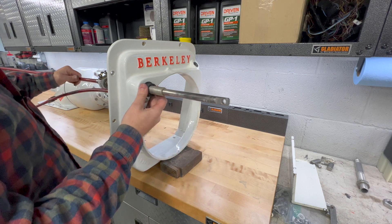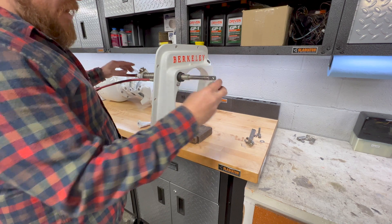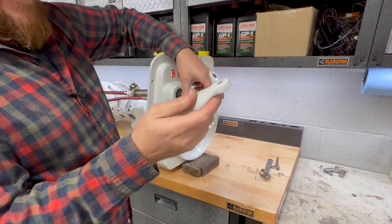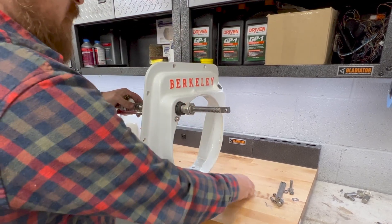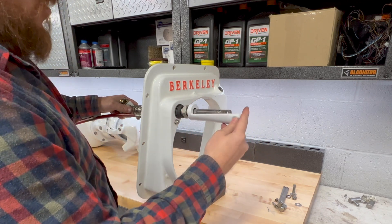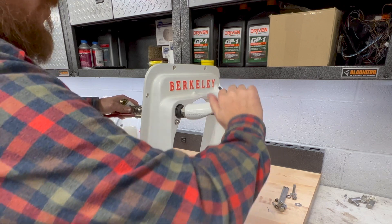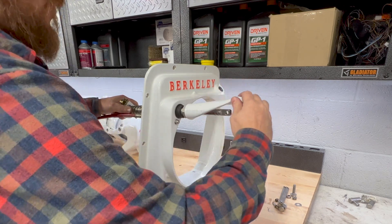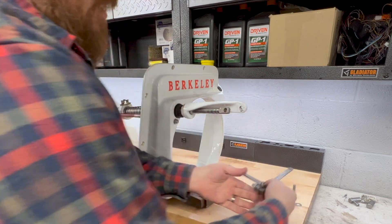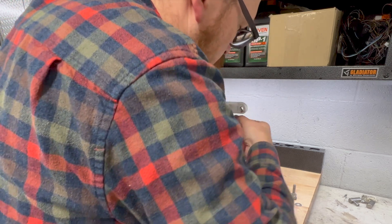Now I can show you that the steering tube moves in and out, and also the steering cable moves in and out independently of one another. The next step is you would have a jam nut back here on the steering tube, and its sole purpose is to lock in the actuator arm for the jetovator. We'll get this threaded on just a little bit. Then the jetovator arm goes over the steering end of the cable and threads onto the steering tube.